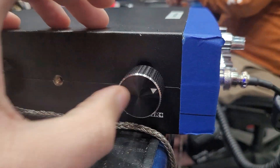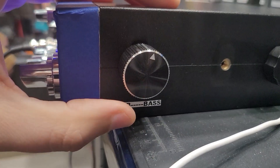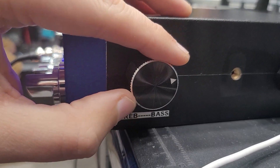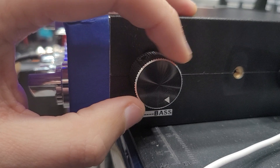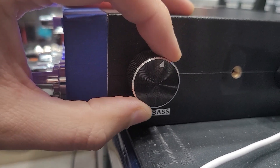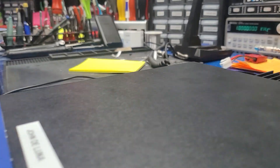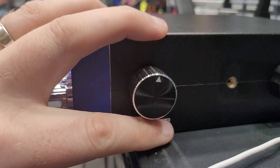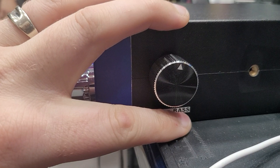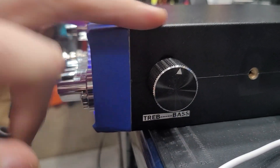This is the average power adjustment, which you already had. We have a tone control here. You're going to run this somewhere around the 12 o'clock position, maybe a touch past it. If you want to be real heavy, you could probably go further. If you go too far down, you're going to take away too much high range — you really need to be at least back around here. All the way to the right is maximum bass, all the way to the left is maximum treble. Even when you go to the left, you still have your bass — it doesn't roll them off, it just adds more highs to make it more dynamic, mixing with the bass that's already there.